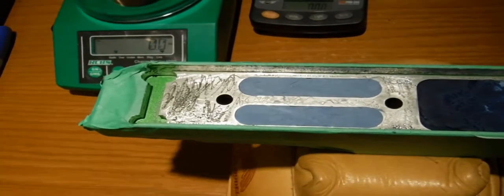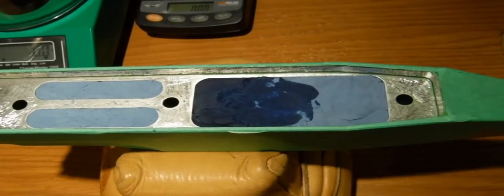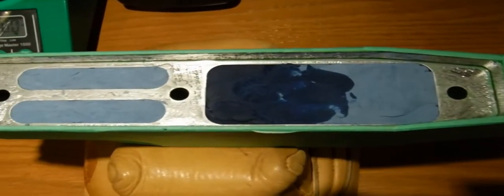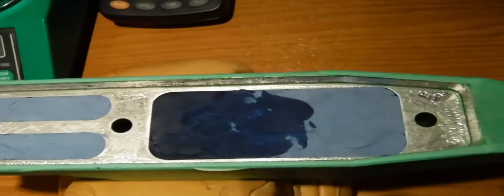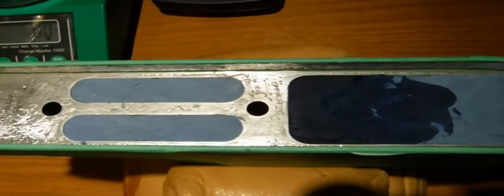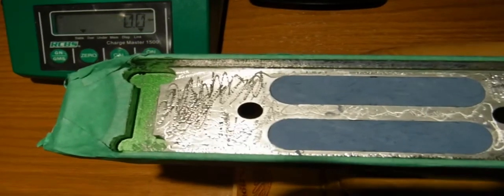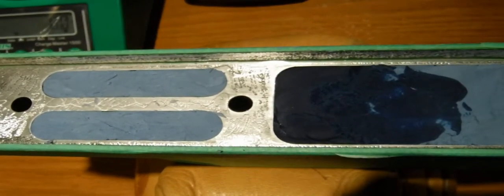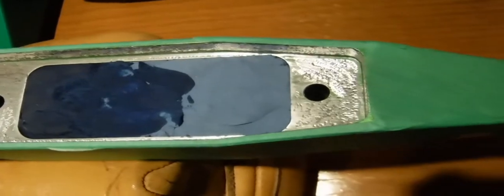What I've done now is I'm bedding this Xtreme Aluminum chassis because of the unevenness of the paint. I've scraped it off and taken a Dremel to rough up the surface, as you can see here. I'm probably going to put in a few little drill bit holes in order to ensure that there's a mechanical lock between the bedding material and the chassis, so that the bedding material adheres to the chassis and stays with the chassis.